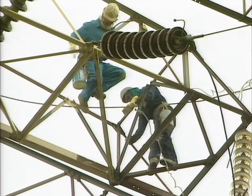You get induction with the line switched off. It picks it up from the other side and throws it back onto the wire again. So even on a dead line without having drainers on, you can still get 10,000 volts in a dead circuit.